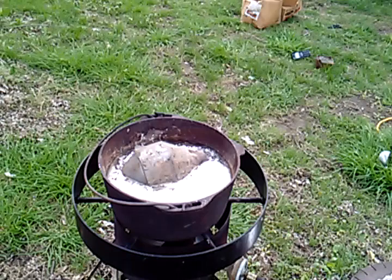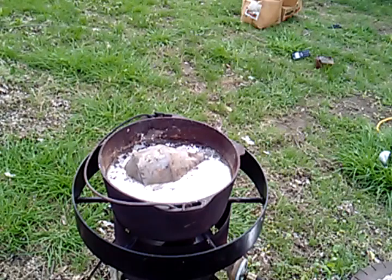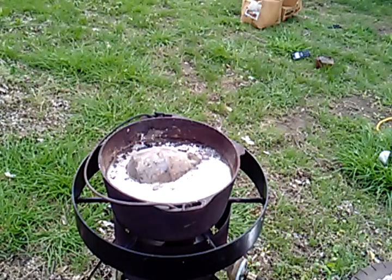And now she's melting. I hope I don't run out of propane on this one. A nice Coleman camp stove works great for this. There she goes. As we've talked about in the other videos, I like to flux my lead at around 800 degrees. Your lead's going to melt at about 622 degrees thereabouts, but I like to flux it hot.